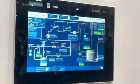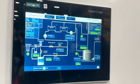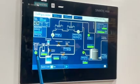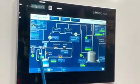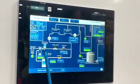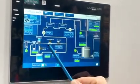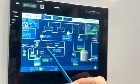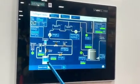On our HMI, we have the process flow laid out, and all the components have their own pop-up menu. So if we look over here, we have the water supply coming in with a differential pressure switch. That water supply is meeting the softener. The softener has water hardness measurement in there. And after the softener, we have 2 solenoid valves. We have one going to the process water that is filling the cells, and we have one fill brine tank solenoid valve. Here we have the brine tank.